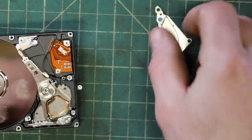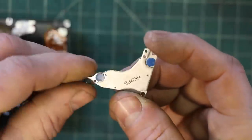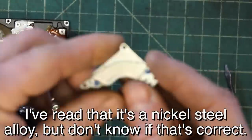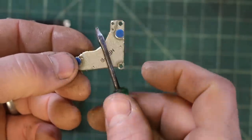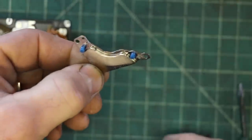That's what I'm after. That is a rare earth magnet that is mounted to a special piece of metal that doesn't let the magnetic flux go through that direction. It's pretty interesting. But very strong that way, almost nothing that way. They're very convenient. If you want to put this on something, you just put a couple screws in and you're good to go.